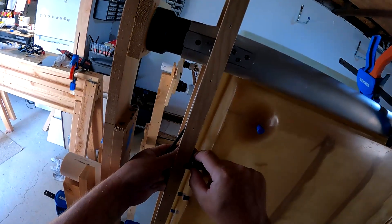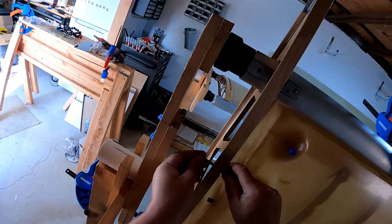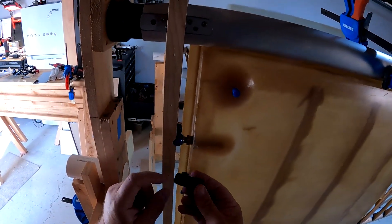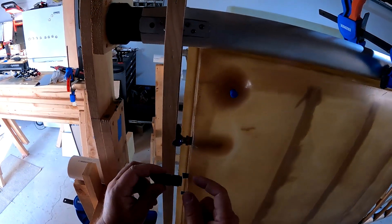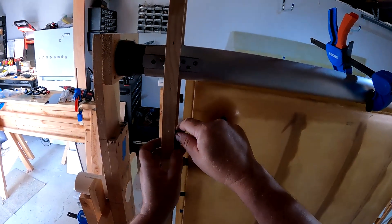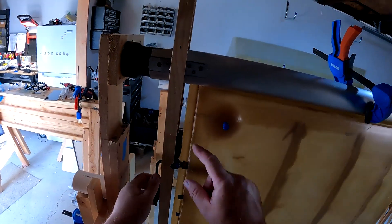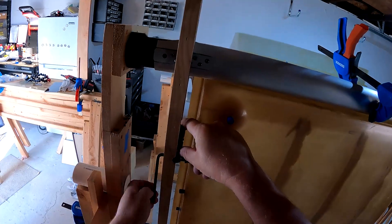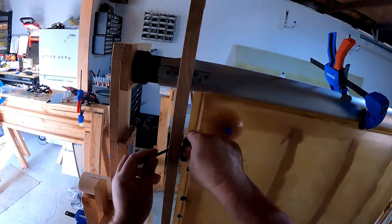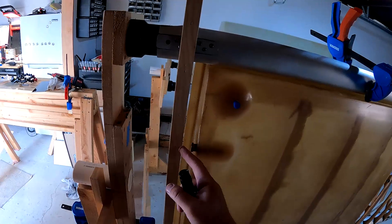This worked a little while ago when I was playing with it. The idea is you have to have enough relief that I can get the thread started without cross-threading anything - that would be bad. You get the idea. Then the big question is can I get the hose on? This is a hose end fitting, so this will go with my AN6 hose. It'll be permanently attached and this will be the swivel end. So it will snake its way in here - it will be tight, but the answer is yes. I think in real life this will have to be tightened on here and I can remove the whole thing. Then if I needed to, I could access it and pop the hose off. F2 touch-up, of course, on all the wood I was just grinding on.